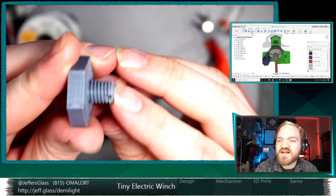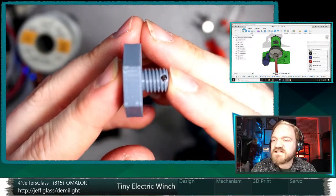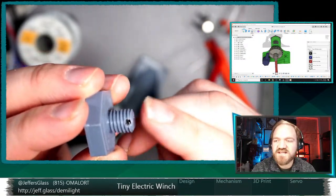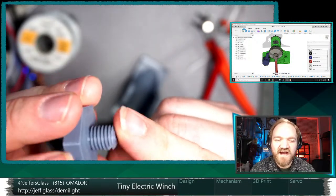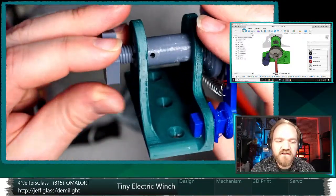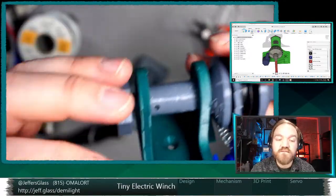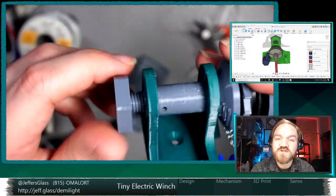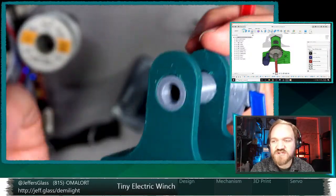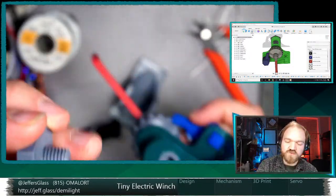Now, of course, this thread is meant to be optimized to, in some senses, maximize the size of the body, the shaft of this, because this bolt is assumed to need some mechanical strength when you're talking about a metal bolt that the ISO is going to spec. But of course, for this application, we don't really care about the strength of the shaft, we care about the threads. And so I have not experimented yet with custom threading, and there's a few different ways that we could do that, one of which would just be to use the coil tool and basically custom etch an internal and a matching external thread, right? And that would allow us to have a thread that was, say, this diameter, which is really what I'm interested in, right?